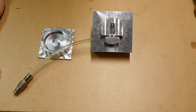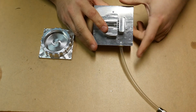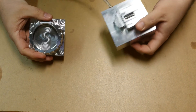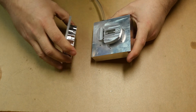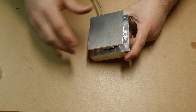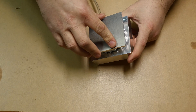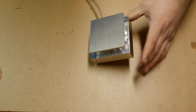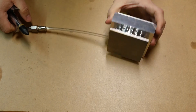I have the prototype here. It's basically a pneumatic cylinder — the cylinder raises and lowers this set of jaws. I have a fixed jaw and a movable jaw; the movable jaw is on a little spring. So when I want to load a bottle cap I just take the bottle cap bottom — the unfinished bottom — and snap it on by pressing the movable jaw a little bit. That's all it takes to essentially load it on. Then what I'll have to do is press it down a little bit by hand and align it with the dowel pins that I have in there.